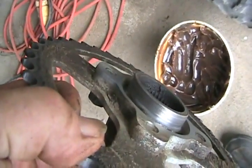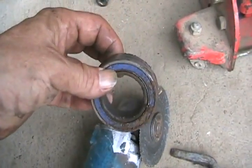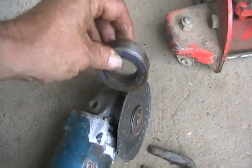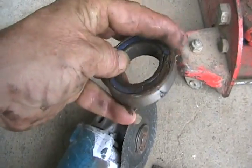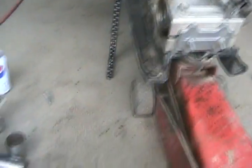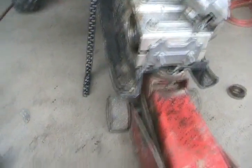I've got that seal surface greased, just have to grease that one and we're all set for reassembly after I get the bearings pushed in. Since I'm going to use the old bearings as an installation tool, there's a possibility they could get stuck in there with almost no way to get them out. So I'm going to split them with a cutting wheel grinder, throw away all the middle bits, and just leave the outside ring of the bearing with a slice in it like a snap ring. Then it'll be perfect for pressing the bearing in, with no tension on it to knock it back out.